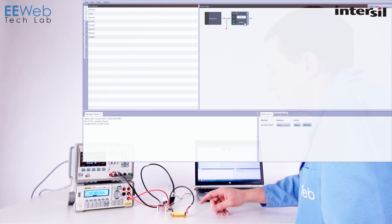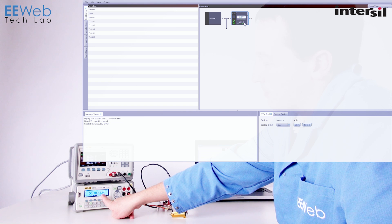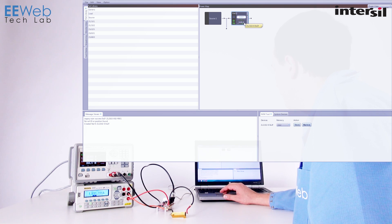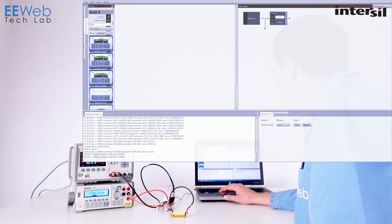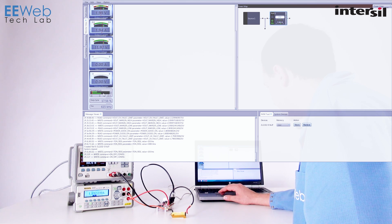It's about what I'd expect — we have a 1 ohm resistor and my current meter is saying it's about 3.18 amps. With it set to 2 volts I'm going to switch over to the monitor view, where you can see a better view of what's going on: about 2 volts out, about 2 amps out, about 12 volts in — all reflective of what we'd expect to see. You also get the temperature of the device, its duty cycle, and the switching frequency.